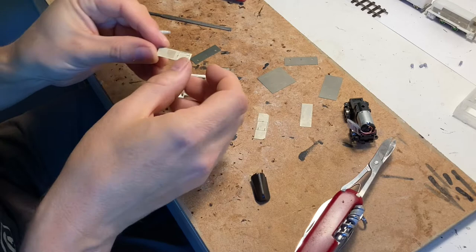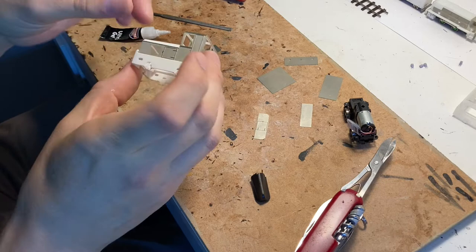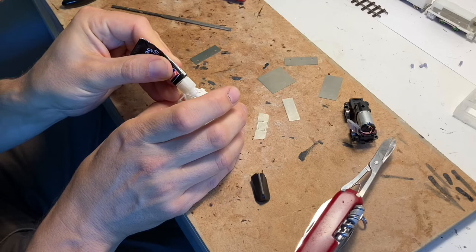So for this piece, I'm going to try and insert it into that join there, and then the bottom edge, and then push home. And if it's all measured accurately, which it was obviously in CAD, then that fits exactly in the recess, and the strapping edge is at the bottom of the angle, perfectly without any messing around. Right, same on this side. Not quite as exciting this side, it's a plain side. Still has the strapping along the top edge though.